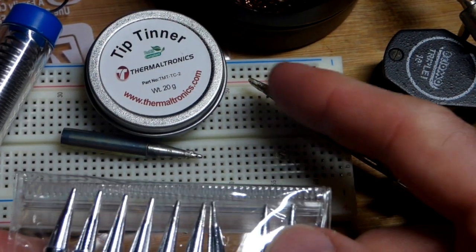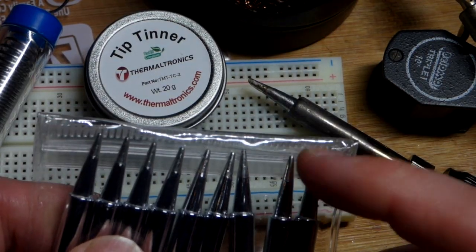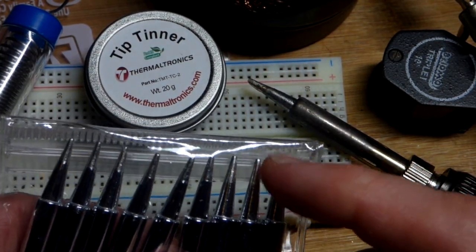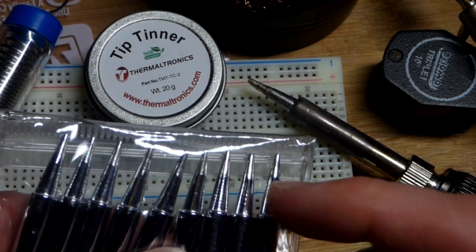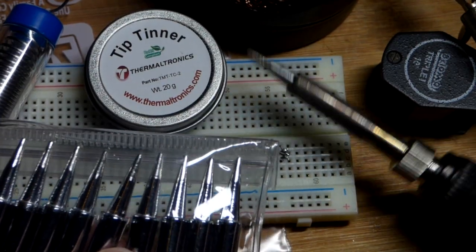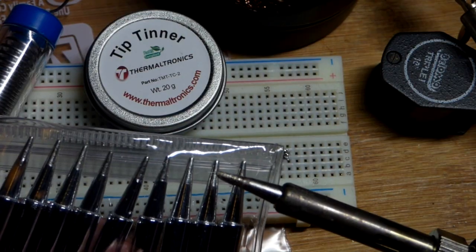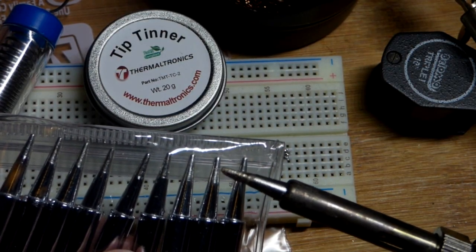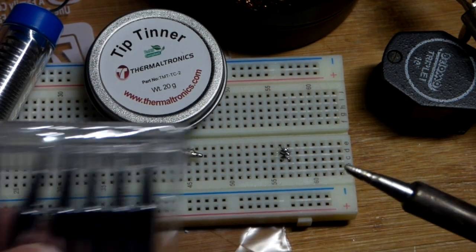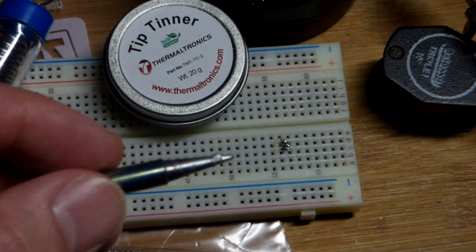This is a new tip right here — this is what they look like new. You can see it's smooth there and kind of jagged there. Solder does a pretty good job when it gets hot enough of coating where it's roughed up. It tends to flow pretty well, and imagine this is solder — you just touch the solder there, it starts flowing and gets smooth. At some point you start getting a ball, and it may roll off if you're not careful — that's probably how some of those splatter ones happened.